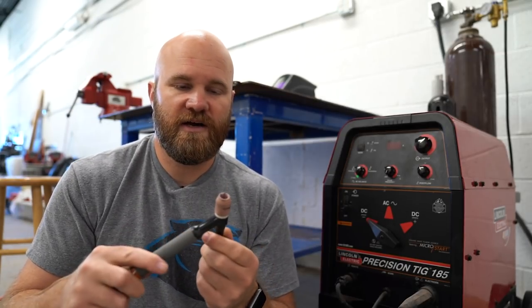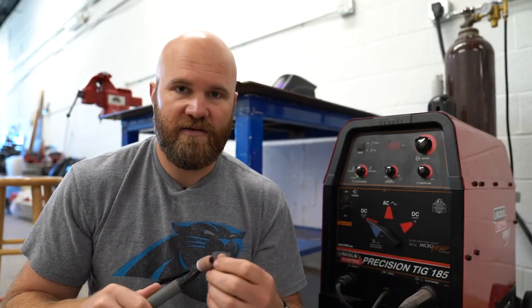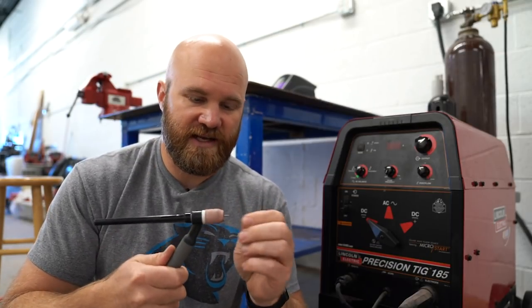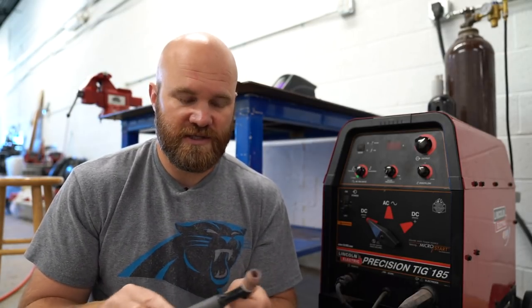As far as the tungsten goes, they use tungsten because it has the highest melting point of any pure metal, which makes it great for welding — it doesn't burn away as you're welding. It can handle something like 10,000 degrees of heat without being too affected. If you do enough welding you will notice it does deteriorate a little bit depending on what you use. They used to use pure tungsten all the time; now they use tungsten alloys most of the time.